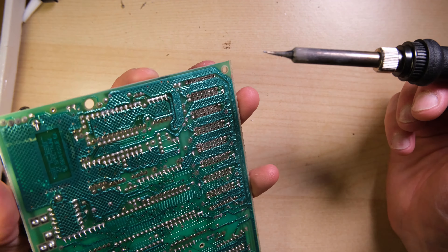First of all we'll replace the caps — there we go, that was easy. I've put the ROM chip back in and we can see if it boots — and it does boot, although it's very dim. I'd say that's too dim, so we're going to have to address it. There's a trick to doing this by replacing transistors TR1 and TR2, located right before the modulator box. I'm basically going to replace these two transistors with others that have different characteristics, which result in the picture being brighter. The type we're going to use is a BC549C, and we have to bear in mind that the collector and emitter are the opposite way around to the ones we removed, so the silk screen needs to be ignored and they need to be put in reversed. Here's before the change, and here's after — I didn't change the settings on my capture card, so that's a real boost in brightness.